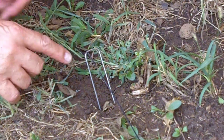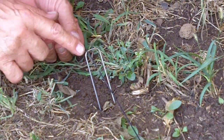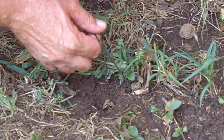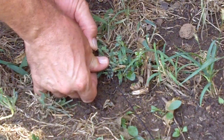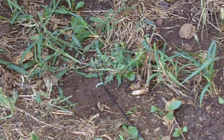I've moved out to the end of this radial wire, and all I've done here is just made one turn of the wire around the top of the sod pin. I'm going to find a nice soft spot in the soil, keep the wire taut, push it right down in there. That wire will never be seen again.